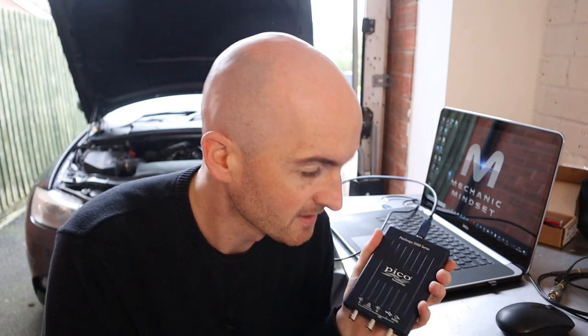We said this scope was set to 20 volts. Your 4425A Picoscope automotive scope will go up to 200 volts, so there aren't many times you'd actually need one of these. The Maxiscope goes up to about 100 volts input, and the old 6022BE I used the other day had a maximum input of 35 volts. All you need to do is multiply the maximum input voltage by whatever attenuator you're using — in this case 20 — which tells you how much voltage you can safely measure.